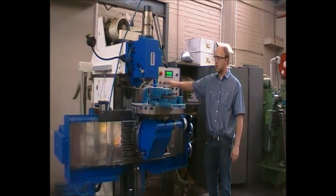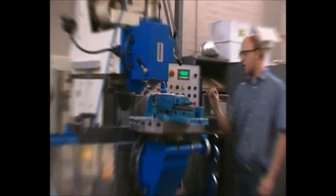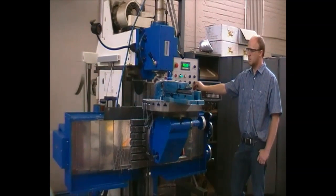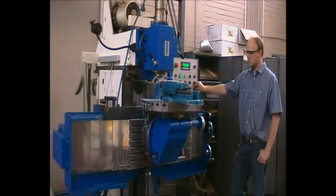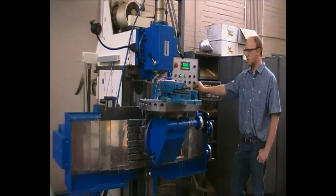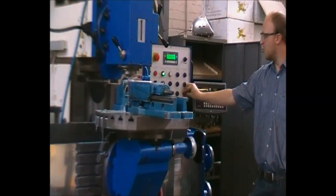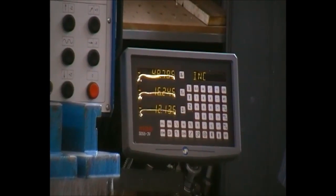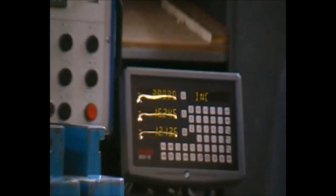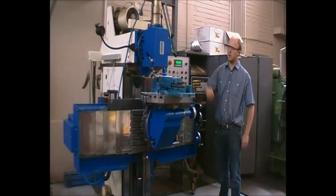Being from a safe distance, we now stop the machine before viewing. There is still a slight bit of material left, so the last 2 millimeter cut will now be taken. Please be warned not to cut into the parallels. Turn off the spindle speed and turn off the coolant. The part can now visually be inspected.